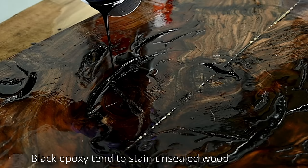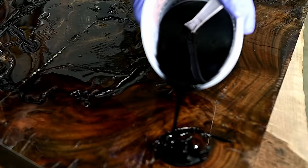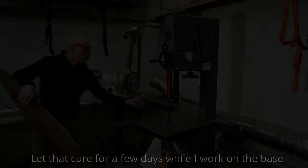All I've done so far is join these boards together with wood glue, and I did use dominoes to help line things up. If you don't own a domino, don't worry about it — wood glue would be plenty strong enough. Then I went and sealed it all with a clear epoxy and filled all the voids with a jet black super clear epoxy. I know that sounds like an oxymoron — that's just the name of the brand. I will include links to everything in the description below.